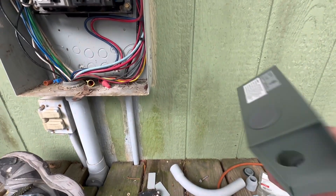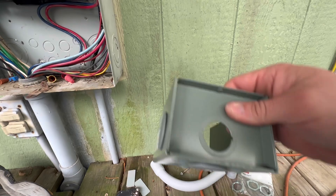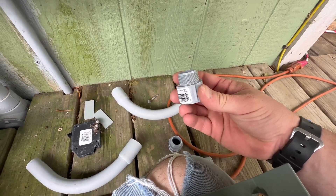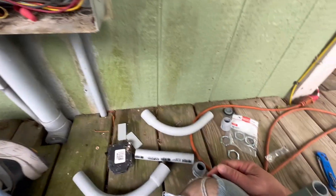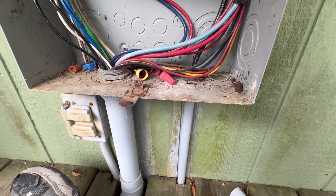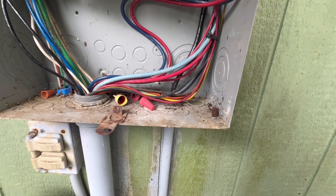Alright, the box is disassembled. The interior gives you options on where to feed your wiring through — I'm going through the bottom hole. There's a little lock that holds the plug in place. I've got locking fittings for the male adapter, three-quarter conduit, 90-degree elbows, and a straight piece of conduit. For the breaker box entry, I chose a rear corner using an existing knockout — you have knockouts throughout your panel so you don't have to drill. Choose the right size knockout for your job; we chose three-quarter inch.